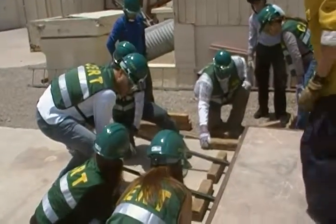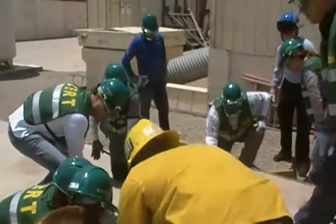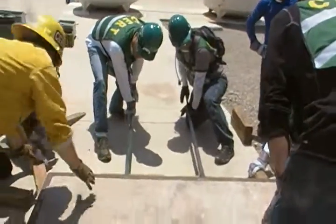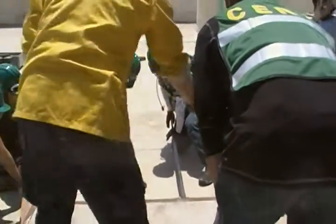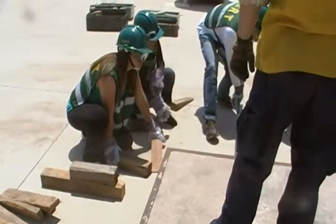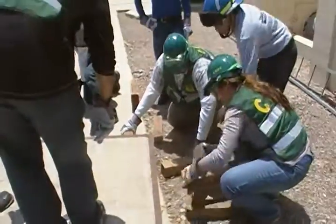Because your fulcrums right now aren't high enough to lift it to get above their entire set. So we want to start with wedges. So you guys say stuck? Stuck. You got a wedge. You pull your 2x4s out, just pull it out. They're not going to be able to lift it. Their leverage is not going to be enough.